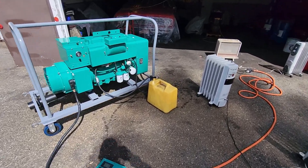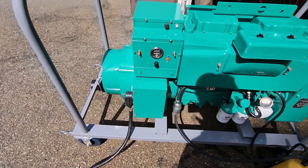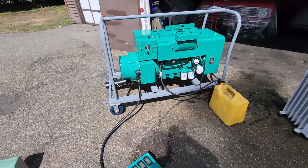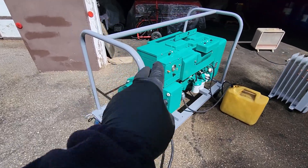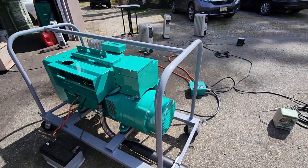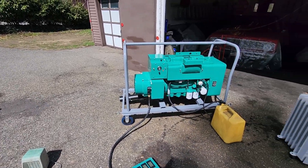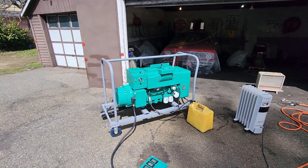We're going to do one more walk-around before we terminate the video. Excellent oil pressure, slightly charging the battery. This device here varies the voltage — it's an option that Onan had for the J-series sets, you won't see too many of them with it. It's a very easy thing to add — just a potentiometer tapped into the voltage regulator. Once again, the Onan DJC — our project we've been working on basically all winter — is pretty much complete, just a couple little doodad things left.